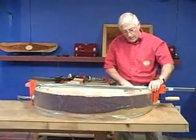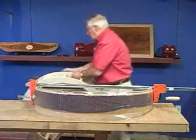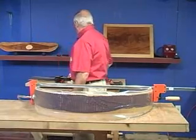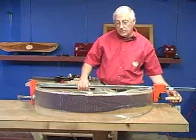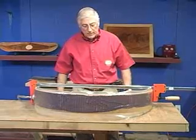What we're going to do is remove these clamps. We'll just put our bar clamp across here, tighten it up a hair, and then we can pull this thing out. All you want to do at that point is measure across your piece and adjust this to give you the dimension that you want — maybe make it a little tighter to allow for a little bit of spring back.